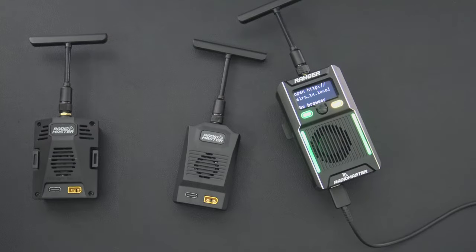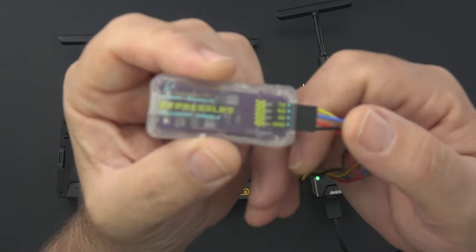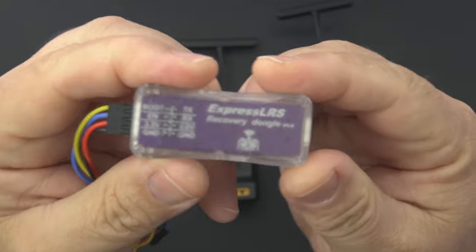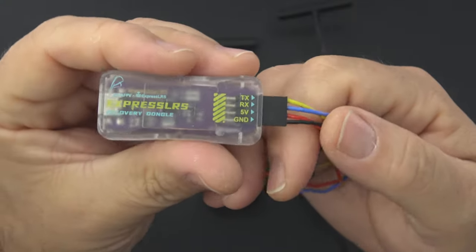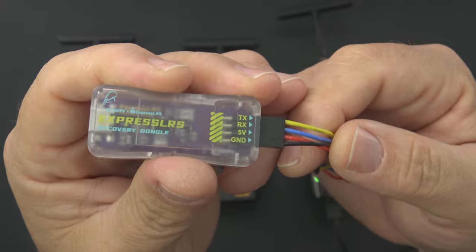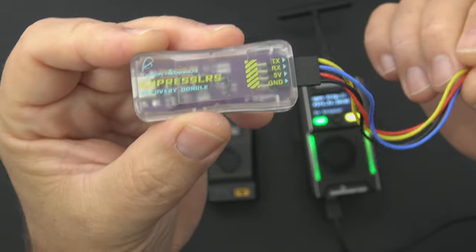And I'm going to tell you guys right now, if you're going to be getting into ExpressLRS, I have a link in the description for you to go get one of these things. Get one of these dongles. Now, this is the BetaFPV version. I put the link for this one in the description. You don't have to use the BetaFPV. You can use any FTDI dongle you want. That's FTDI, Foxtrot Tango Delta India. You can use any of these that you want. They all work. I like this one because it just worked out of the box.